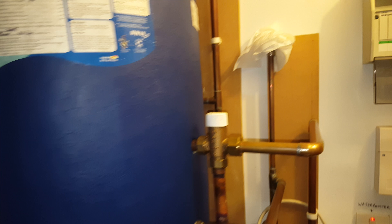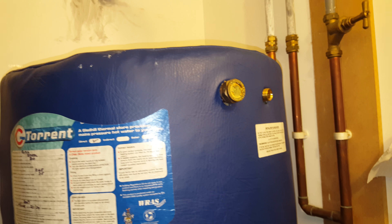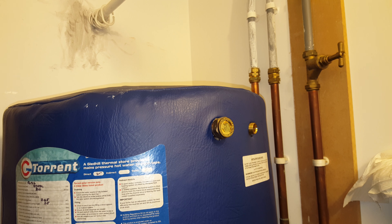This particular boiler has a problem where there's no water in the boiler. This is because it's been plumbed in really badly. There's no feed pipe to the ball valve — there's the ball valve connection there, but there's no feed pipe and there's no overflow connection either. So this is a bad installation.